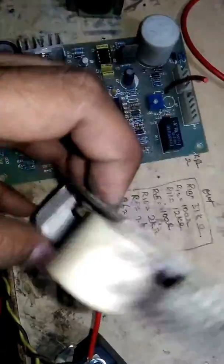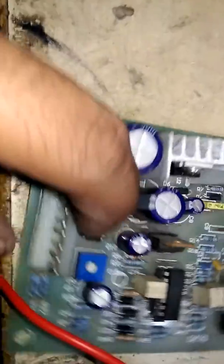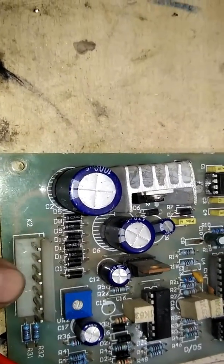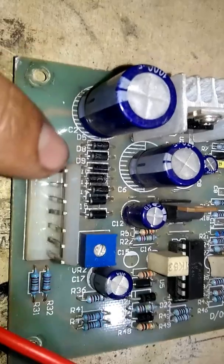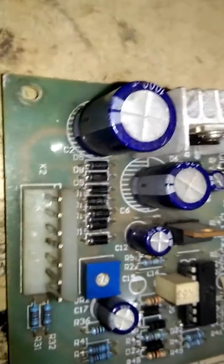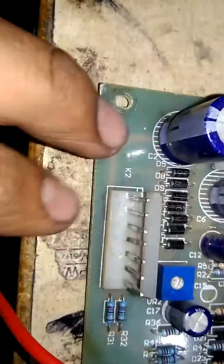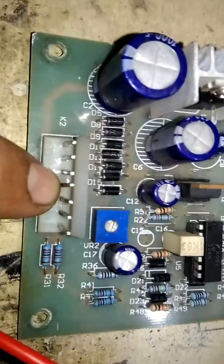Taking one card — you can see there are seven things here. Starting from the left side: pin number one, two, three. At pins one and three you need to supply AC — 18 volts. At pins two and three you also need to supply 18 volts. So you need a step-down transformer, which can produce 20-0-20 or 18-0-18 volt output. You supply that voltage to pin numbers one, two, and three. Pin number four will be empty — no use.